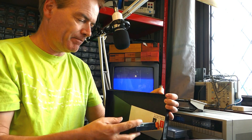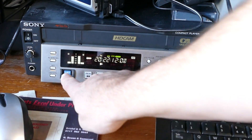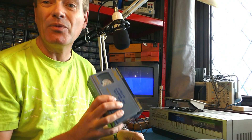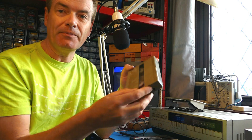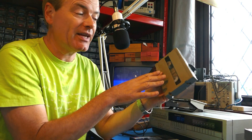Onto HDCam — this is a large HDCam tape; they also made small ones in Betamax size, and of course exactly the same guide is in there. Now, I'm a great believer in Beta as a format — it should have succeeded better than it did, although you could argue Sony probably made more money out of Beta than anybody ever did out of VHS. There was an attempt at making something professional from VHS — here's a domestic VHS tape, but the tape has no opportunity to get behind any guides. The same is true of the professional VHS format called M2 — again no opportunity for the tape to go the wrong side. There was very little interoperability between these; M2 failed miserably, while Betacam SP was far more successful.